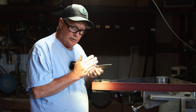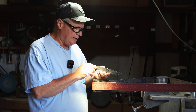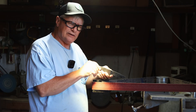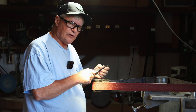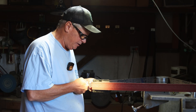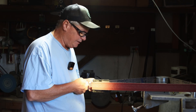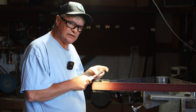A lot of times you'll move your tang - like I mentioned in the last video, the blade and tang can be offset a little bit. This one is very, very slight, so I'm not too concerned about it, but we will get it straight and square. I'm going to come in here with a rough, worn-out belt to begin with, and then move on to a fresh belt after I remove some of this scale.